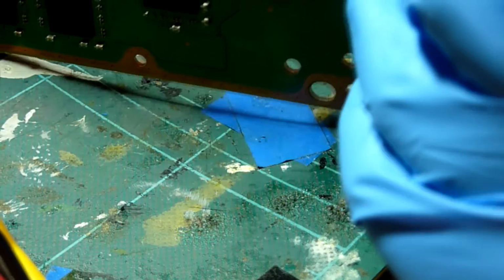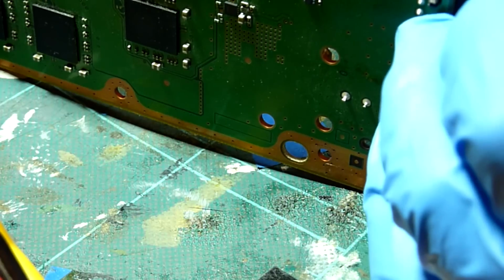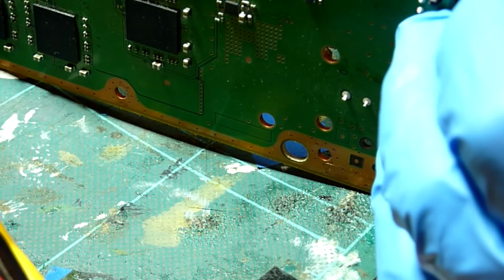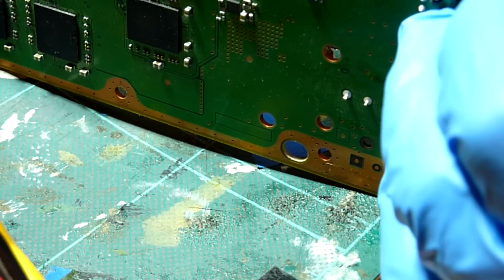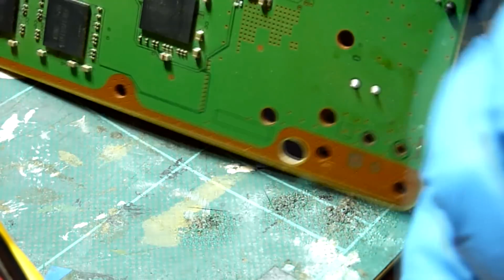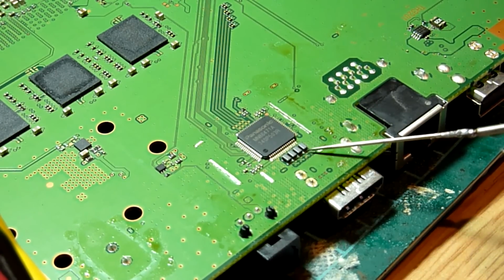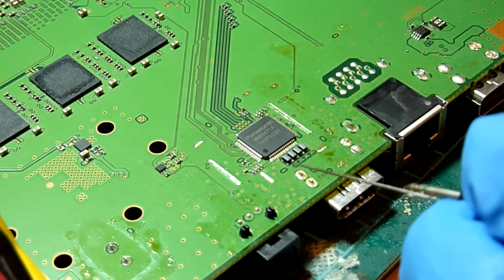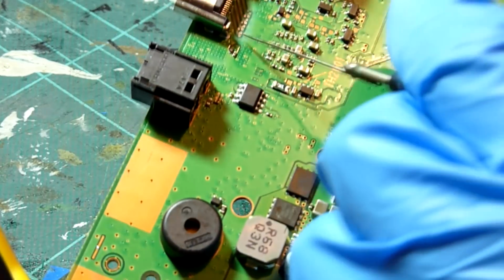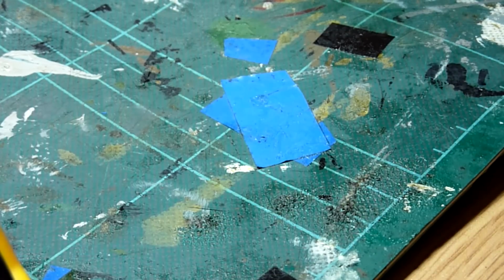So we're going to go from, there are 8 pins, we know the connection between the HDMI encoder IC and the bottom of these little filters here are good, so we're going to go from the bottom legs of the filters, from these 8 points here. One probe, the black probe, is going to sit on the first point here through to the vias on the top side, so the first via, and so on and so forth, back and forth across the board on all 8 of those connections.